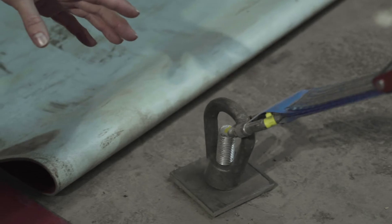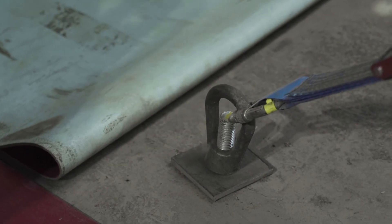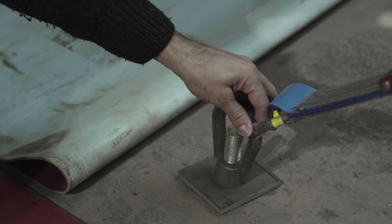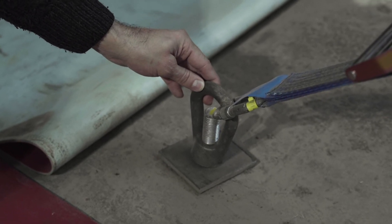Let's look at some individual pieces of equipment. The first is an eye bolt — a device fitted into concrete, either up into the ceiling or down into the floor, held in mechanically or chemically. This definitely needs to be fitted by a professional to meet working load limit requirements. Here we can see an example of an eye bolt — in fact, this is an eye nut on a length of threaded rod. We've got quite a thick threaded rod that has been sunk a good distance into the ground and chemically bonded in, with enough clearance to clip things into it. This point is set up to take up to a tonne and has been regularly tested to ensure it continues to be safe.